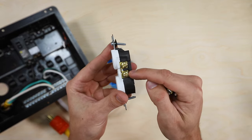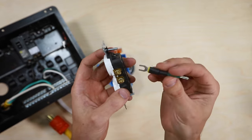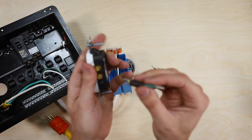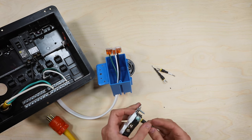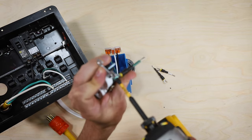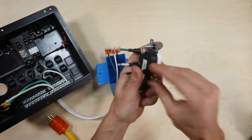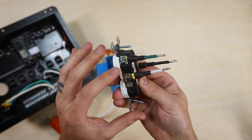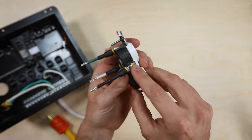With stranded wire, we can't put stranded wire underneath these screws, so we need to use fork connectors like these — a fork connector crimped onto the end of wire with heat shrink on it. We're going to connect these to all the terminals in their appropriate spots. We've got our green wire on the ground terminal, white wire on the neutral screw, and our black wire on the hot terminal.